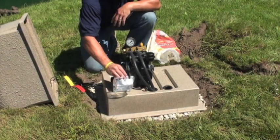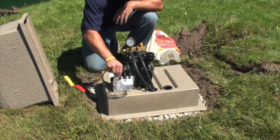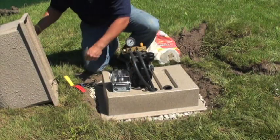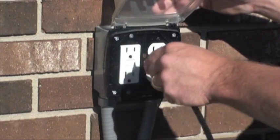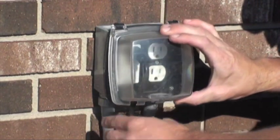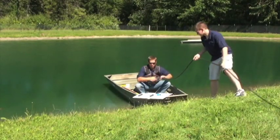After the airlines are connected and the diffusers are assembled, it is time to prepare your system for start-up. Plug your compressor and cooling fan into the power outlet inside the cabinet, then connect the power cord coming from the cabinet to the standard ground fault circuit interrupter — also known as a GFCI outlet. The system should now be running.